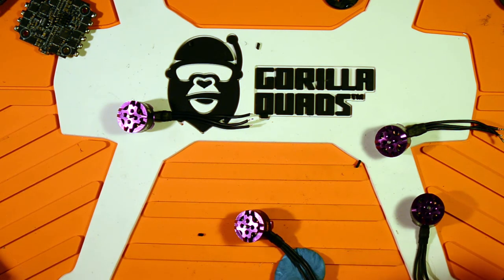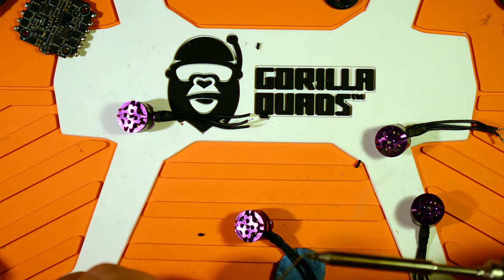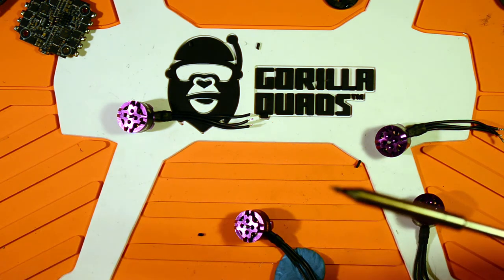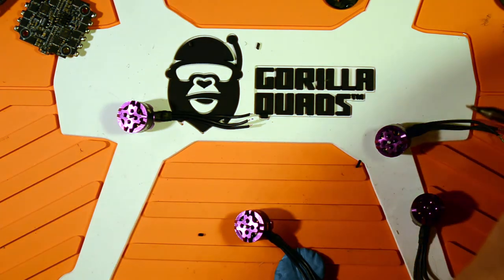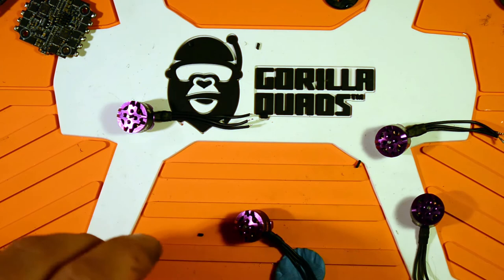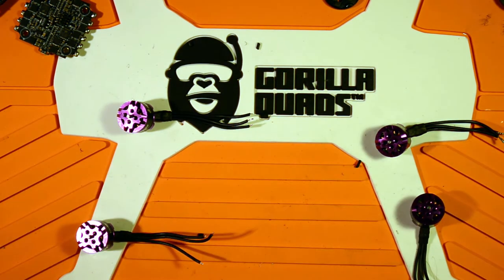So I'm going to turn it off, and before it cools off, take your solder and stick a bunch of solder on there. Now this is another super important thing to do, because that solder will cover the metal on the tip. And if air can't get to the metal because the solder's on there, it's not going to oxidize nearly as fast.